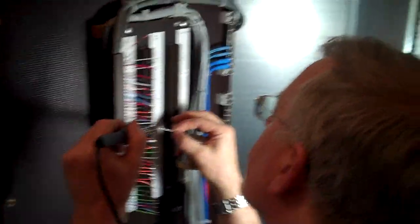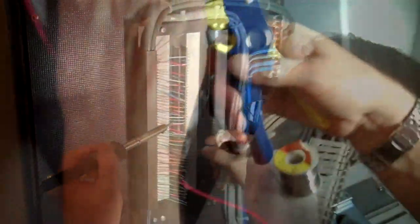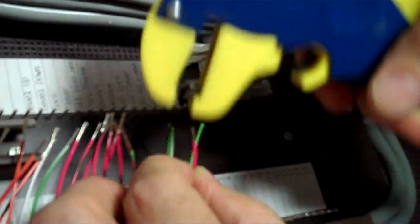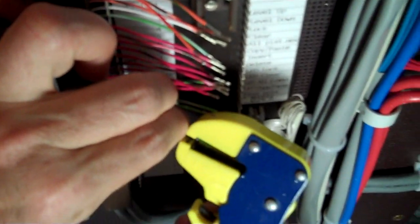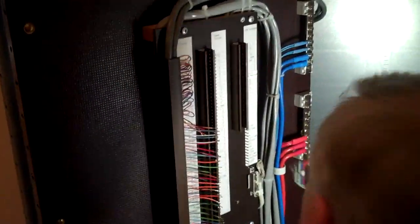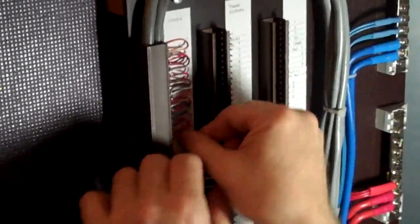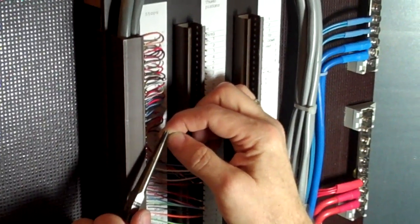We're at the back of the instrument. Good morning, afternoon. Bruce is preparing that little panel. A little wire stripper — sometimes you have to take a razor blade and circle the wire, cut half of them out. It just clamps down and pulls it off. A number of days ago we had you identifying the wire with the appropriate draw knob. Now this is installing it in the box that will have the little computer with all the little memories for draw knobs.